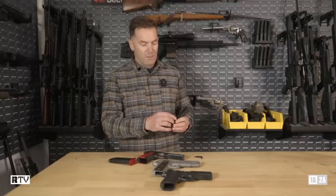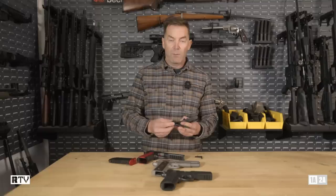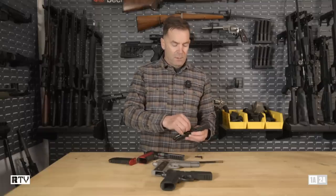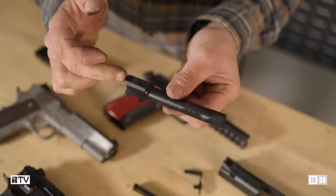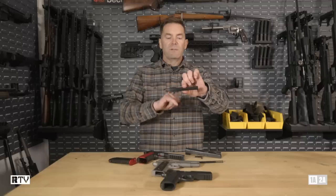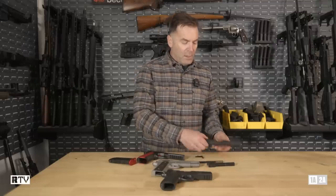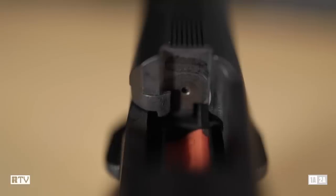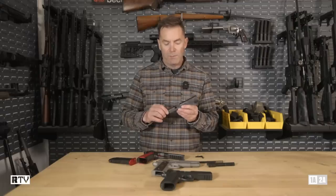With the slide off, the recoil spring is non-captive — it's kind of like a full-length guide rod in a 1911 — so you can change that out and adjust your recoil spring to suit your own individual preferences. Looking at the barrel and its locking lugs, you've got a Browning Hi-Power style cam path and a SIG P220 style locking block. The extractor is external, more like the CZ-75 than a 1911, and it's quite long, so you should have no problems with extractor longevity or tuning.